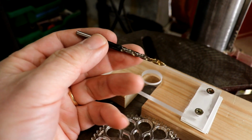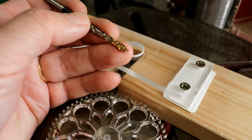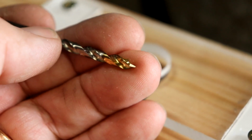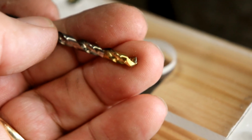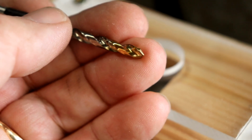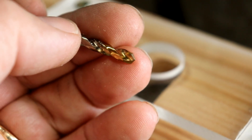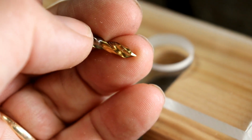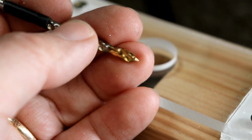And this has got tape on, because drill bits, normally high-speed steel drill bits, general purpose ones, have very sharp cutting edges that actively cut into the material, such as wood or metal, and scoop it out. Whereas with plastic, that's not very desirable. Plastic is far better drilled through by scraping. So what I've done is to grind off and make the ends of this drill bit absolutely flat. So they're nice and sharp, there's a nice angle on there, but they're not slanted forward, so they don't cut it out, they scrape it out, and it makes such a difference, it really does.